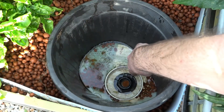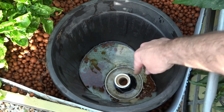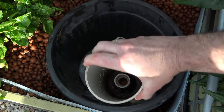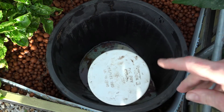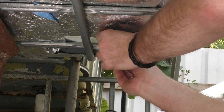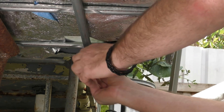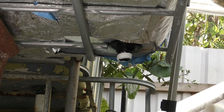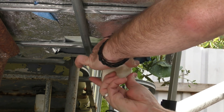It doesn't look like we've got any drips coming through there, and there's a fair little bit of water accumulating down the bottom. I'm just going to thread on the standpipe and pop it in. It actually doesn't have to be watertight, because any leaks are going to go straight through into the sump — so just finger-tight on that, and then the guard goes back on. So I'm just going to pop the bell in, the end cap — that's the lid — and then put the drain work on down below. Now I'm just going to wrap some Teflon tape around this thread here, try and get it sitting nice and flat, and this will just create a bit of a watertight seal between the drain and the thread. Then we thread on this, which is just a 1-inch or 25-mil threaded elbow — thread on one side, and the other side is just the push fitting.